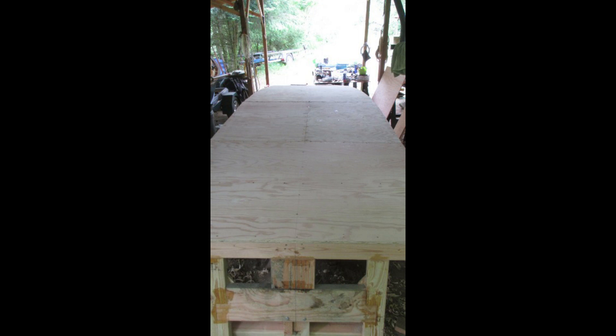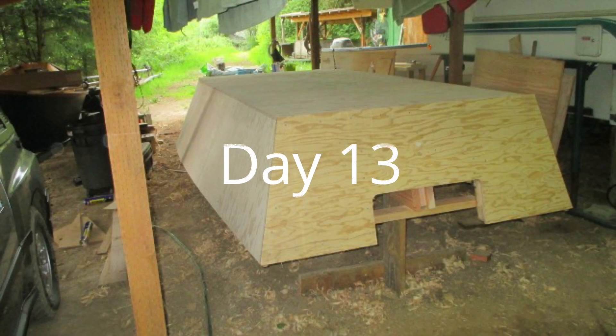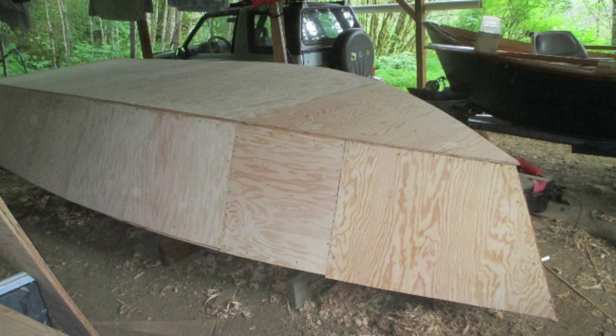It was back to the drawing board to figure out the best way to cut three sheets of plywood for the bottom to get maximum structural strength with the fewest pieces. I wanted all butt joints on the frames. What I settled on was one sheet across the transom butting on frame 2 with about 7 inches of overhang to be trimmed at the stern. I did the same with another sheet between frames 4 and 6. The 3 feet cut off the ends of those two pieces butted on the keelson in the space between frames 2 and 4. The remaining forward section uses less than half of the third sheet. All plywood was on the boat.